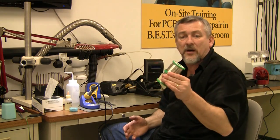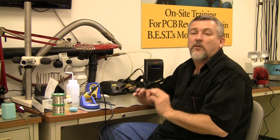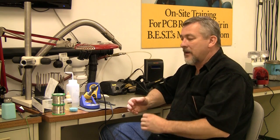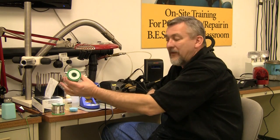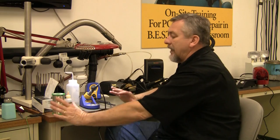The next item is the solder itself. This is wire wound solder. I use .010 or .015 for all surface mount, because you don't need a lot of solder in there — a little dab will do you. It's not a big blobulous mass that you need to see. I use it with a center core flux and it works great.